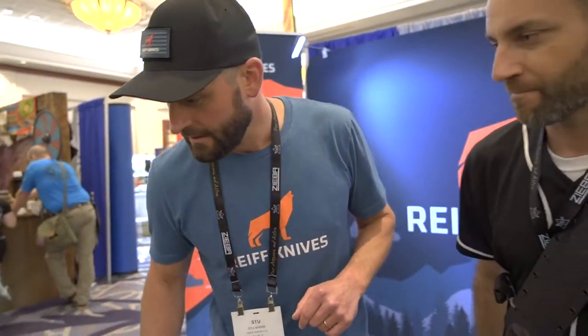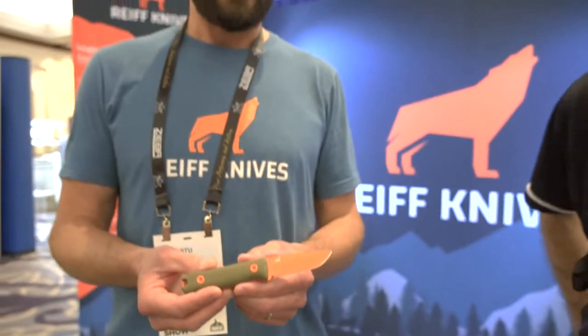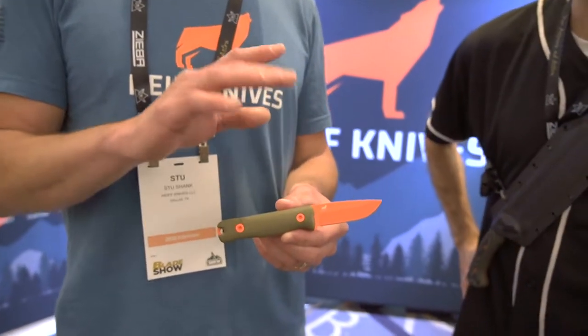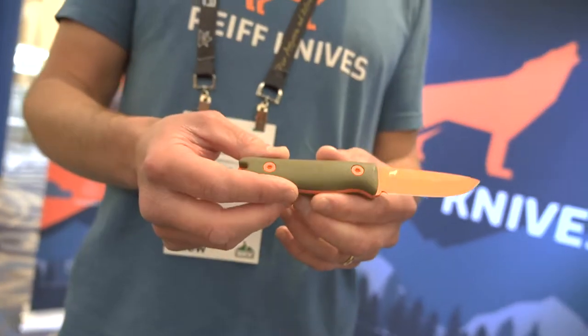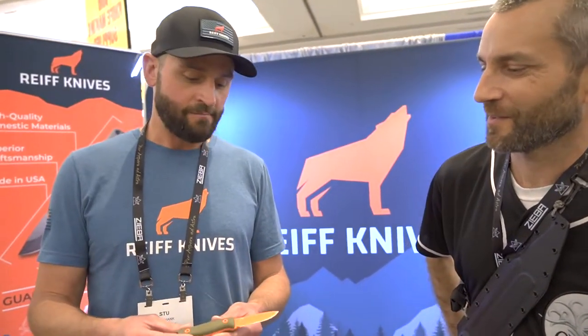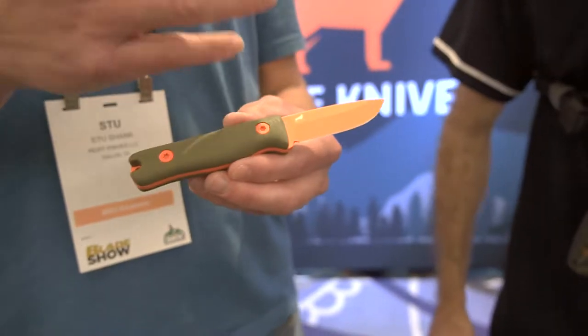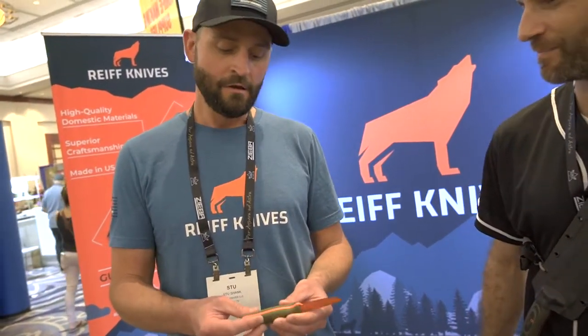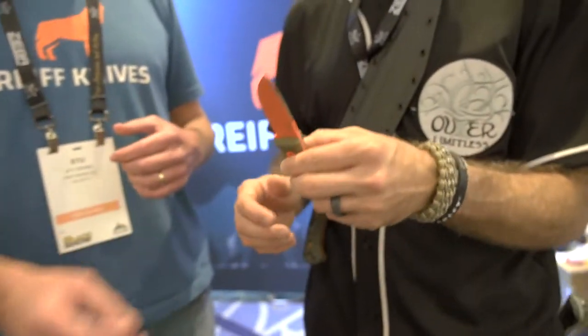These aren't on the market yet, but let me show you my personal favorite color combo. These are our F3 XCs — about a three-inch blade, actually 2.97 inches, because we wanted them to be a good EDC. You still have a very tough woods survival knife just at a very small scale, able to carry around town or straight into the woods. We're going to launch these in two variations. The XC has a stouter tip for extreme conditions and a Cerakote finish — we grind the Cerakote off the spine so you can still strike a ferro rod. That's 1/8-inch CPM 3V at 58-60 Rockwell.